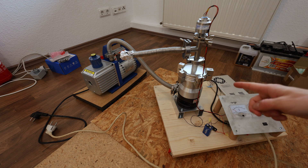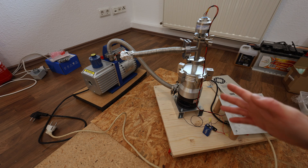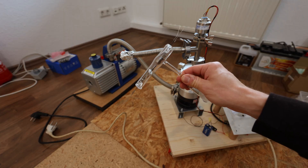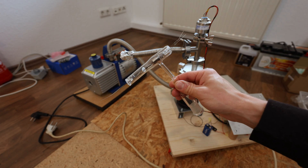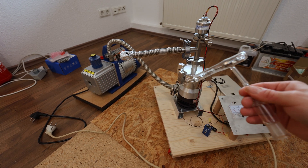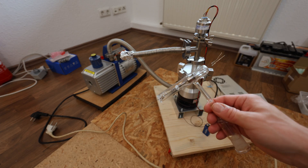To be real with you, I already tested all of this and didn't film it because you can only see the gauge moving and there's not much to see anyway. Now I can move to the next step. I mentioned in the beginning I want to pump down some vacuum tubes with this system. I made an x-ray tube — a little bit better version than what I made years ago. I think I'm just going to put this on the pump and leave it on there without sealing it off yet, so the high vacuum pump can pump it down to the correct pressure.